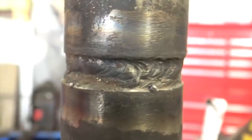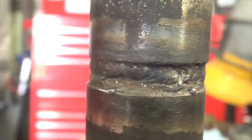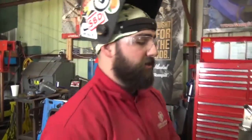What's going to happen is we're going to cover this edge up, cover the middle up, cover the edge up — pretty simple stuff. This is a small diameter pipe, but for those who've welded a horizontal bevel before, just look at it like that: cover the edge, cover the middle, cover the edge.